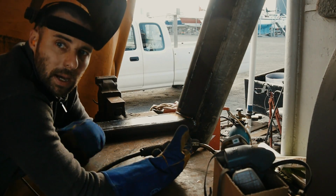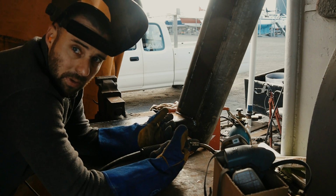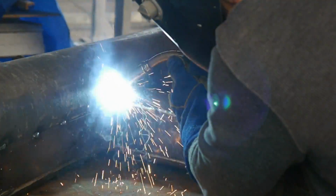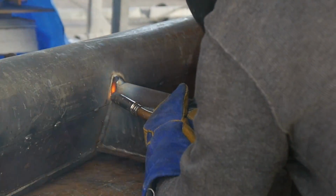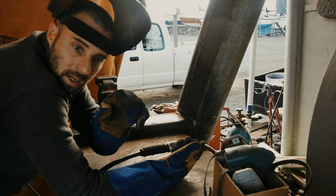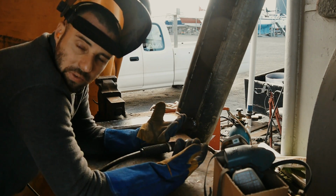So earlier Jess was talking about putting a gusset into this lower part of the wing here. I'm basically trying to form the same sort of thing with a weld. Obviously it's a tiny little gusset, but it gives you a weld that's significantly bigger than if you were to just run one bead all the way around. You'll often see this sort of thing on really high critical areas, like anchor shanks, on some of the anchors that are welded together, like Rockners and Mansons, where the shank comes down onto the blade, and it's welded around there. They'll either have one really big weld, or if it's manually welded together, like some of them are, they'll have multiple runs overlapping each other, so you get a bigger and bigger weld, if that makes sense. Basically it just means you've got more weld holding on to more steel, so you end up with a much stronger joint.